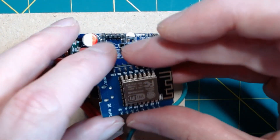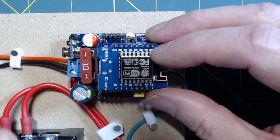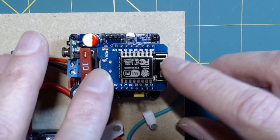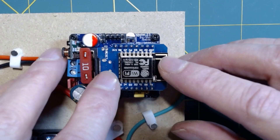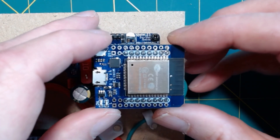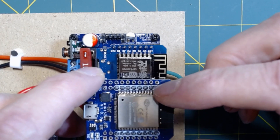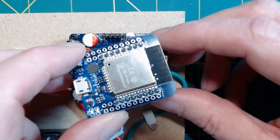It is possible to build your own if you can't get a QuinLED board. I've got a separate video on building your own WLED controller for about $6 using the D1 Mini. However, if you're using 12-volt strips, you'll need to step down 12 volts to 5 volts via a buck converter, or power the controller off a separate 5-volt supply — but remember, you do need a common ground between your controller and your LED strip. This original version came with the Wemos D1 Mini and ESP8266, but this year I'm upgrading to the ESP32 for sound-reactive WLED. You really need the ESP32 for better performance and more effects.